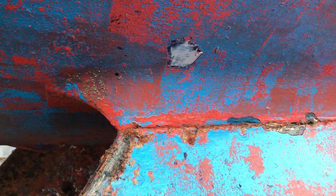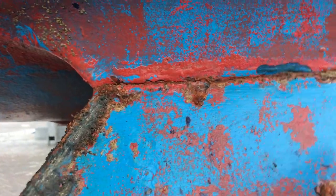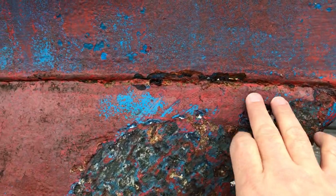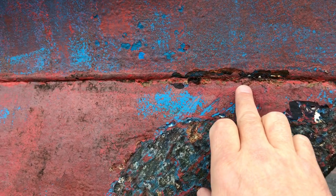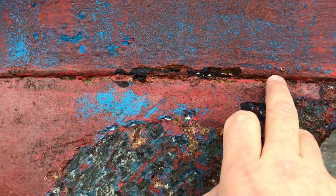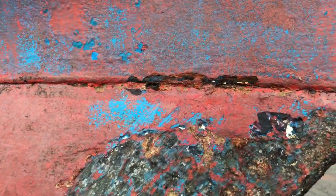That's something for a surveyor to advise on. Now, if I look along the keel joint, we're looking to see if there's any water draining away. There will be water draining away when the boat is initially pulled out, but that should dry up and stop. If any is persistently draining through from the inside of the boat, that could indicate a problem. We're also looking for a gap — if the keel has come loose or hit something, there could be a gap there.